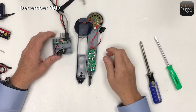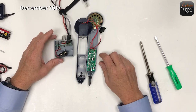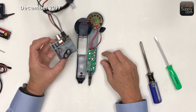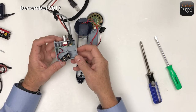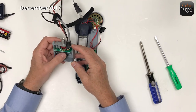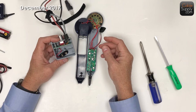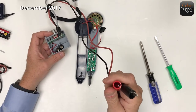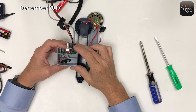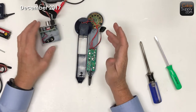Years ago - decades ago - I was training technicians, and this guy desperately wanted to be a telephone tech. I sent him out to do an install and he was having problems getting the phone system to work. He came back and said he needed a new toner. I looked at it and it was all black and sooty and burned up. He said he was checking the continuity of the 110 circuit - he had cut wire and stuck it into the outlet, which of course destroyed the tone. Obviously this is only used for low voltage, so you don't want to use it any other way.